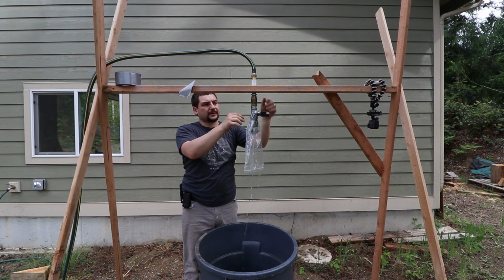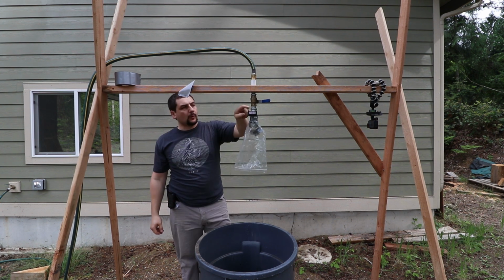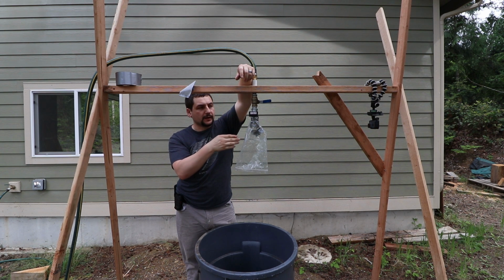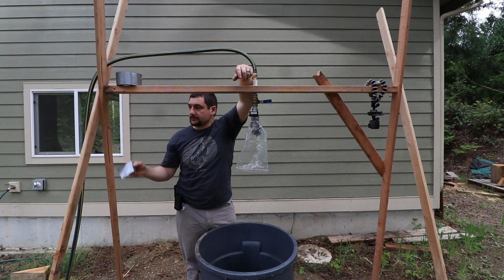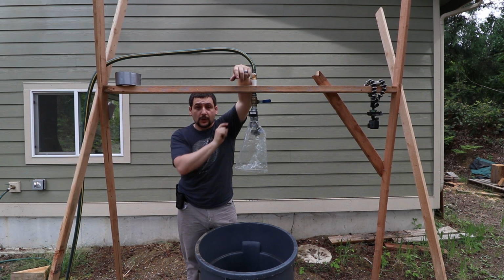So I have determined that I'm going to change out this gauge. This gauge is 0 to 100 PSI. I just ordered a 0 to 60 PSI off Amazon. What I noticed on here is the needle was barely coming off of 0 when the water was flowing through here. It's very important that the needle go to the correct reading specification. There's criteria that the inspector is going to use to determine if your test is sat or not, and if you can't read the gauge well enough, he's not going to call the test sat.